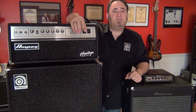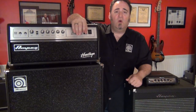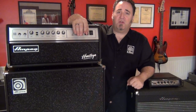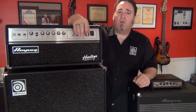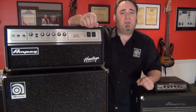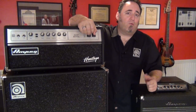So what happens if we go the opposite direction and go below four ohms? Let's say two ohms. Well, the amp might work for a little while but it'll eventually thermal itself out and protect itself by momentarily turning off the power section. That usually indicates that there's something wrong, meaning it's trying to run below its nominal impedance, or the impedance it was designed to operate at. Typically most bass amps are rated at eight and four ohms.